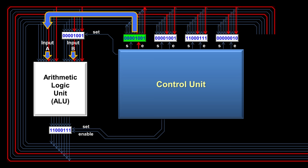The control unit knows what operation to tell the ALU to perform because of the instruction it receives from RAM. The instruction itself is in another register called the instruction register. The input wires from the bus won't affect this register since the instruction was already saved in a previous step. This register, like the temporary register, also has no need for an enable wire since it just outputs to the control unit. Based upon this instruction, the control unit tells the ALU what type of operation to perform. With a compare instruction, we're not interested in the number output by the ALU — we only want to know how the two inputs compare, and for that we use flags.